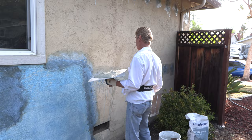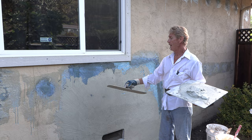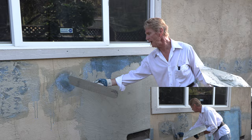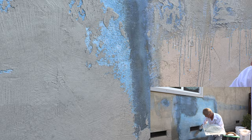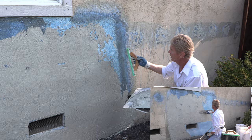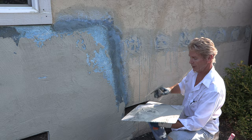We had a little bit of audio problems — the heat left the camera in the sun. I was explaining this area here but hadn't finished when Jay said we lost audio. This guy here was okay. Then they had another guy come in, and this guy only had an idea of what he was doing because he used the wrong grit. This finish here — he spread it, then he took a float and brought the sand or aggregate out. But if you look at the existing finish, they don't have that. All they have is a texture spread with a texture on it. They put the base coat, then a texture on top.